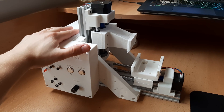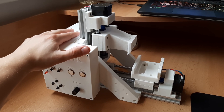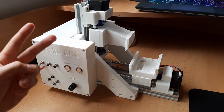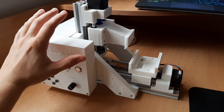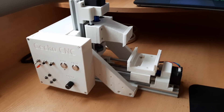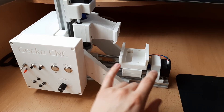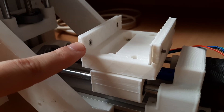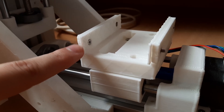It's been a long time since I last worked on the CNC machine. I was busy editing the hexapod video, so all the clips you saw are two months old. But now I'm back and I want to finish it. The biggest problem was obviously the wax slipping, so I redesigned the vise. I added a grip pattern to the jaws so the workpiece won't slip as much.